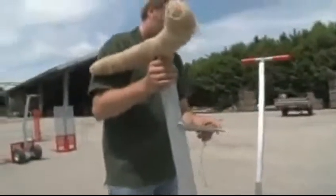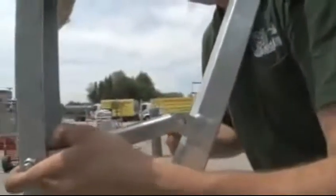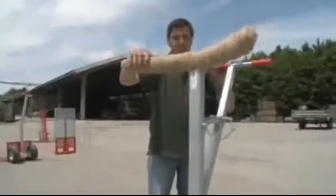The branch bracket is fixed with pins to the top part of the adjusting strip on the basic device. For stabilization purposes, the support bracket attached to the branch bracket is folded out and fixed to the top part of the transport cart with a pin and a safety hook. For the protection of the branches, the branch bracket should be wrapped with jute.